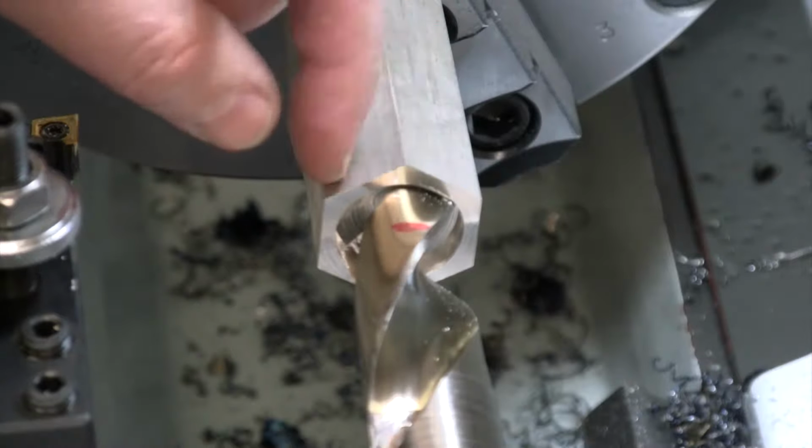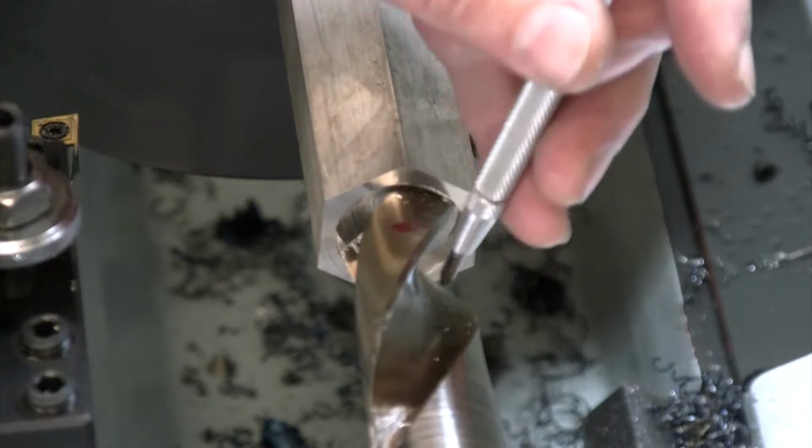So what that means is the drill may be drilling a little bit oversized, it's drilling a little bit more off of this one side, but bottom line, it's still cut pretty well. If you're using a drill bit, you are not going for a precision, exactly the right size hole. You're trying to get rid of material in a hurry, and that's what a drill bit does. But we want to make sure it cuts nicely and it's sharp and able to do that.